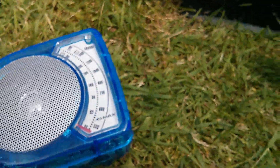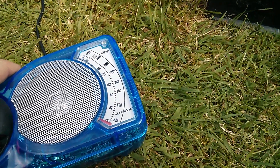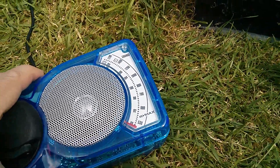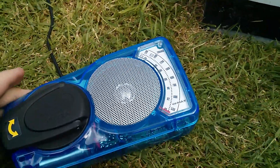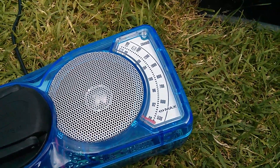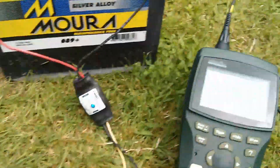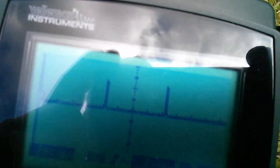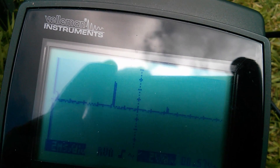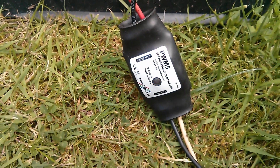I'm getting this third tone again now — there's the root tone and there's the third tone, and it's definitely coming from the scope. It's like a chord — like C and E. So there it is: PWM visible on the scope. Now we've got lots of on and very little off, and in fact it's virtually gone out of PWM mode because there's virtually no sun.